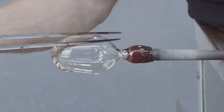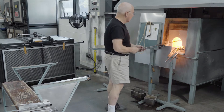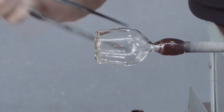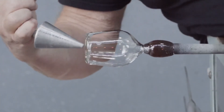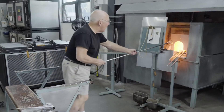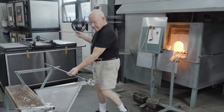The shape of the sides is set. The bottom is reheated. The punty is slid in so that the glass at the tip of the rod will be soft when it's needed. The bottom is flattened and the sides are reinforced. The site where the punty will be attached is cooled gently with a soft blow of air. And after a flash, the vessel is transferred to the punty.